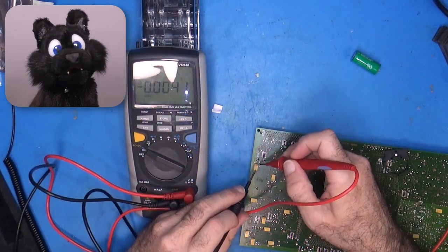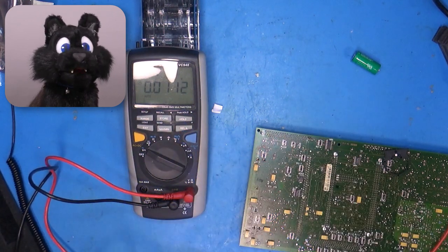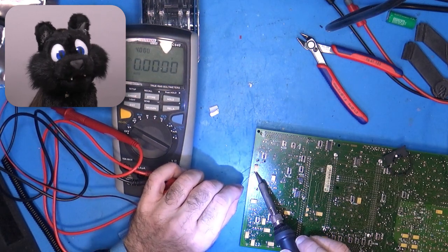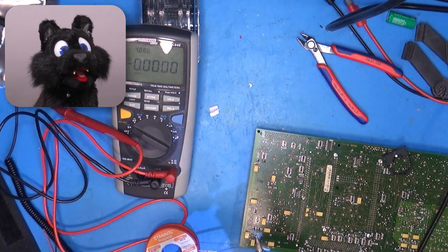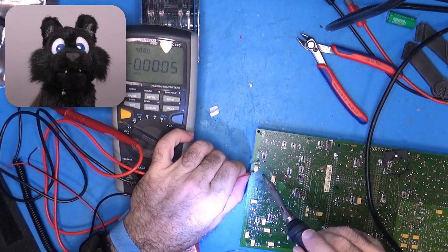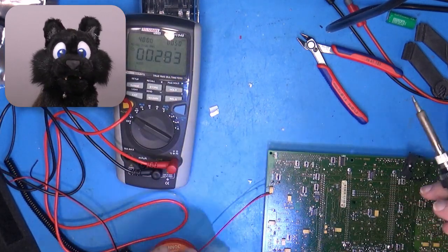First, the battery. The new one arrived. Since I have no idea if there is any calibration data kept by the battery, I'm looking for the 3 volt on the board, solder in some temporary leads and power the thing from my lab supply while I remove the old battery and solder in the new one.